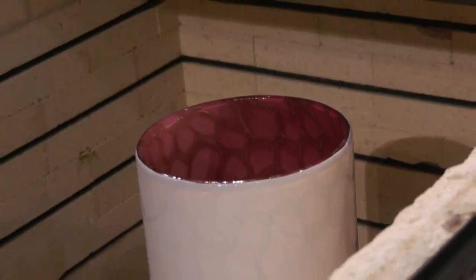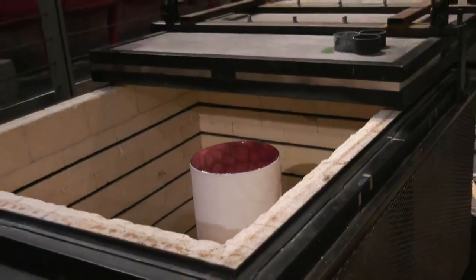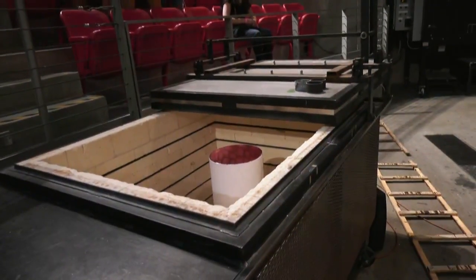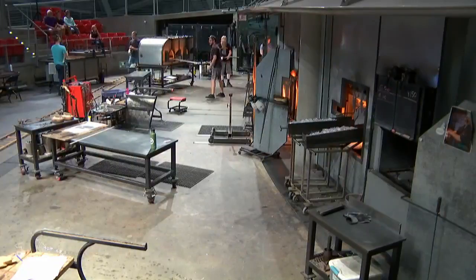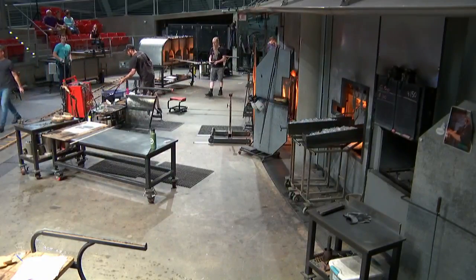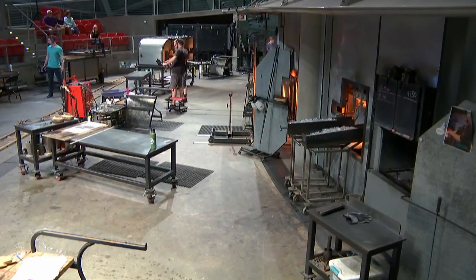Now, this glass maker would make a cylinder for you, like we see on that top screen. They would then cut the bottom off and then cut it through the side. And once we had this cylinder, we would heat it back up, and as it heated up, it would begin to unfold, leaving a sheet of glass. And that's how plate glass and sheet glass was made for a very long time.